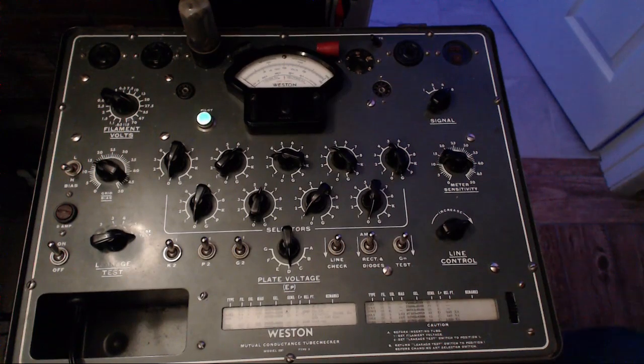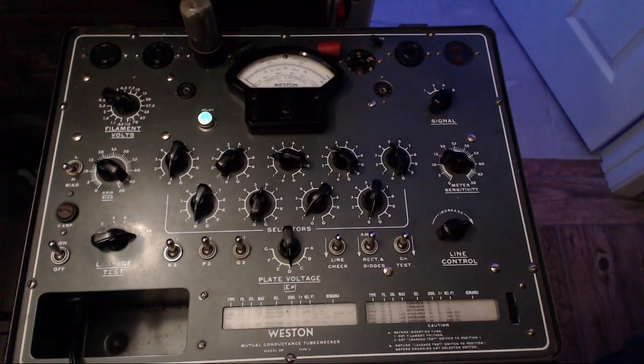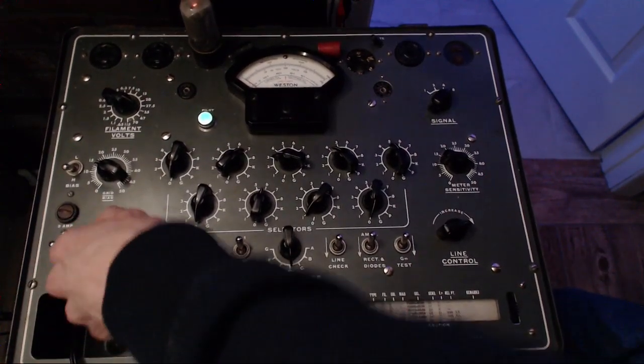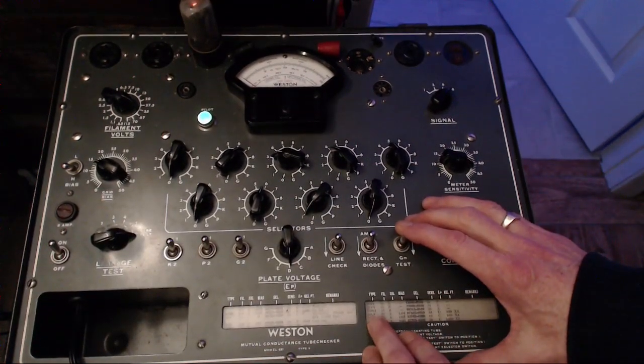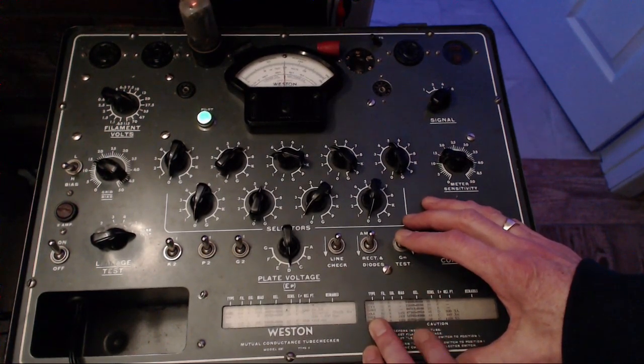Now, once again, because the radio's working, there's a fat chance that this tube is really, really sick. But let us find out anyway. No shorts showing up between tube elements. GM test. Still warming up. Oh, this is why this radio is so slow. It's this tube. And it's way, way up over 1,000. Way up. It's at 2,000.